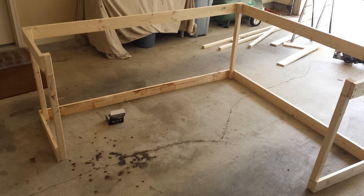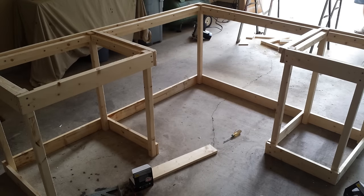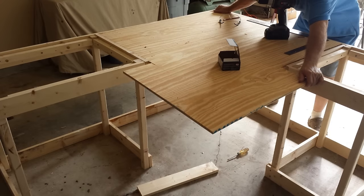Towards the top of the desk I put a little lip on the outside. I wanted an old pallet wood rustic look under the plexiglass, resting on a plywood foundation. The pallet wood alone would break through without support, so I put a plywood foundation underneath and added a half-inch lip around the edge — however thick the plywood was — to make everything flush. To cut the plywood pieces, just lay the plywood on top of the desk, take a few measurements, and cut around where you need to.